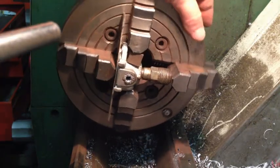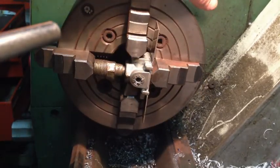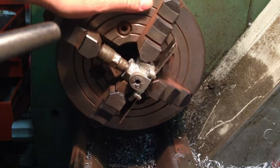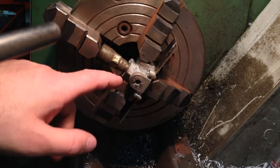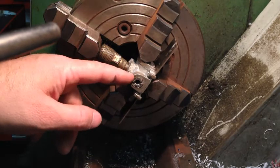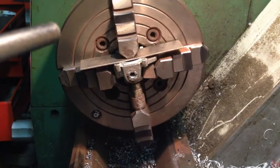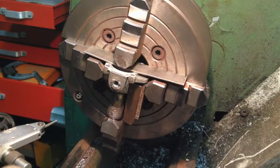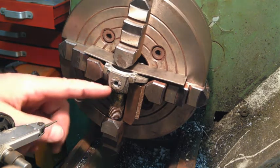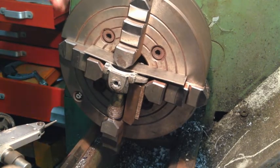At the moment we're not running true yet, as I did the other day. Once we get this one in centre, we take the readings off this one and then put the same readings onto this side here, then it'll run true. That's my next step. I've pretty much got it set up in the lathe — I've indicated on this edge, that edge, and the back edge.